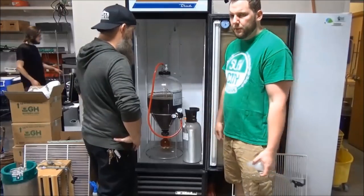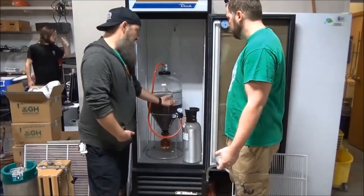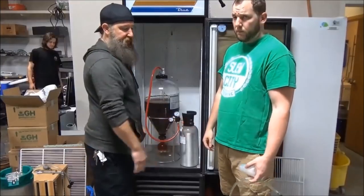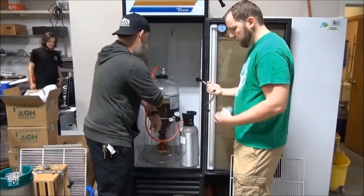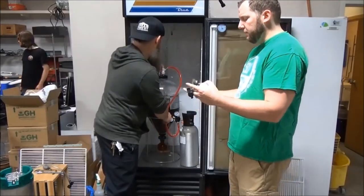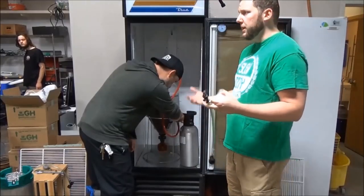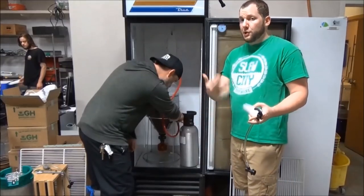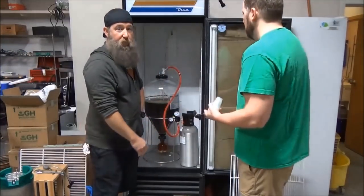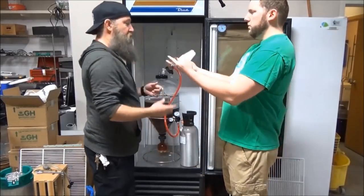So for our viewers, how low do we want this pressure to go? We're going to degass it and then probably turn this up to 2, 3, 4 psi just so it's not going to fly out of this little pigtail. We're doing this because we have such a short space right here. Whereas if you did the proper length of hosing — which we've put on a chart before in our previous videos — you should be okay. You should be able to leave it right on that 12, 13, 14 psi range.